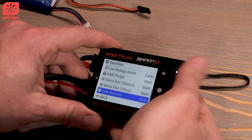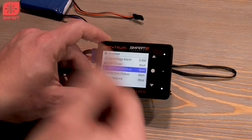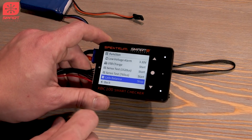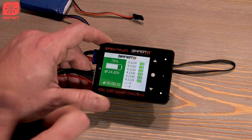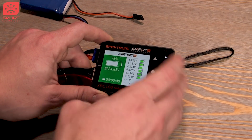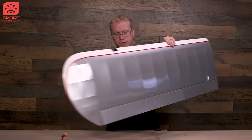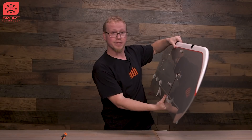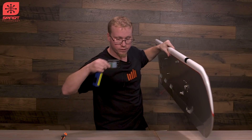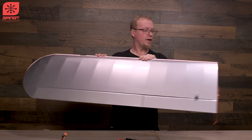The piece de résistance is servo test mode — this is a servo driver. It allows you to hook up to your buggy or plane to get endpoints right without needing to connect your full radio system. Like if you're building a big plane, this is a great way to get your setup going. I'm going to pull up a Carbon Cub 60cc wing to demonstrate. I want to hook up the aileron servo and test its limits — seeing the amperage pull and the throws we can obtain, or simply center the servo. It outputs a standard five-volt servo signal.